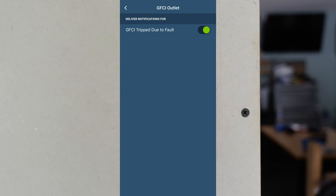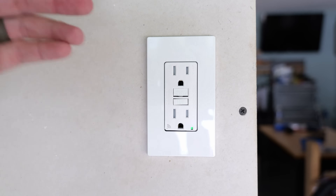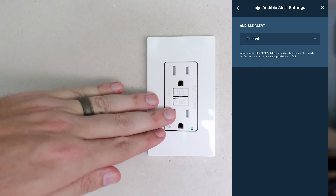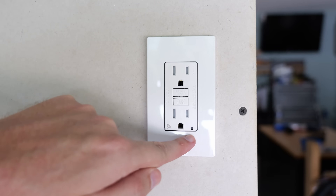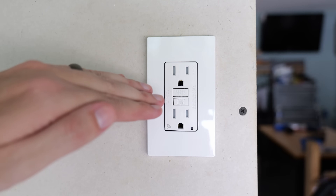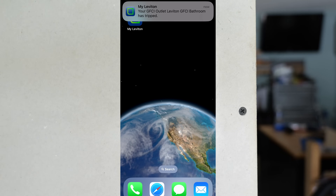You can go into your notification settings and turn on the notification setting so if the GFCI trips it's going to send you a notification. I also have a setting in the app to turn on the audible alarm, so when there's a ground fault it will also make an alarm noise. I'm going to simulate a ground fault now so you can see what that looks like. As soon as the ground fault happened we lost our light, you heard that click noise, and now you're hearing the audible alarm from the GFCI drawing your attention to it. You're also going to get a real-time notification on your phone that says your GFCI outlet — Leviton GFCI bathroom — was tripped.